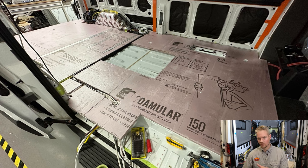I'm using XPS insulation — specifically Owens Corning Formula 150, one inch thick. Paired with a half-inch subfloor that gives an inch and a half total flooring thickness. Compressive strength is important here — if you use something like wool or 3M Thinsulate it will compress and you'll lose insulative value plus it won't support the floor well. XPS won't squeeze out under weight. We'll cover how you can still use compressible materials with a different building method.